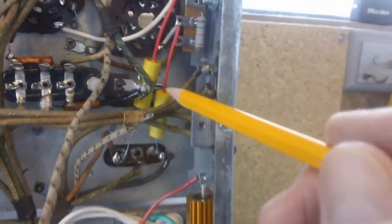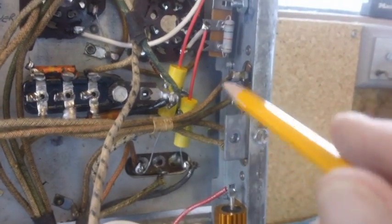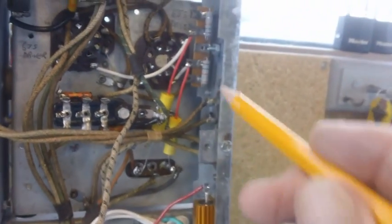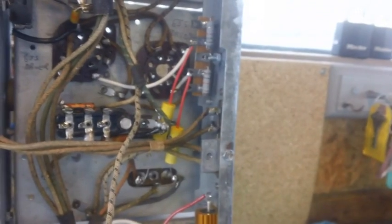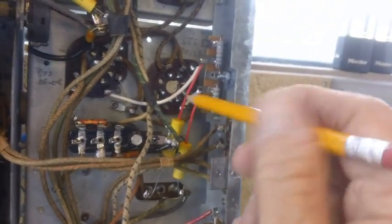And once again, I soldered them in so you can read the writing. Anytime you put a capacitor in, always put it to where the writing is out, where you can see what value it is, what voltage it is. Do not turn them around to where the writing faces the chassis. You can't see anything that way, okay?